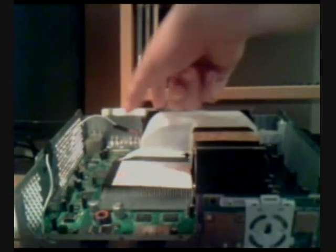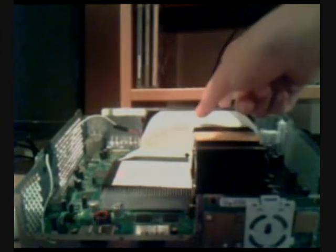Overheating problem with my Xbox, because this fan over here would not spin, and this one would, and this fan wasn't strong enough to keep the Xbox going for more than 5-10 minutes, then it would overheat. It wasn't a red ring of death problem, but obviously I couldn't play like that. Since I bought my Xbox off eBay, it was outside warranty. Microsoft wanted $150, so stuff that.